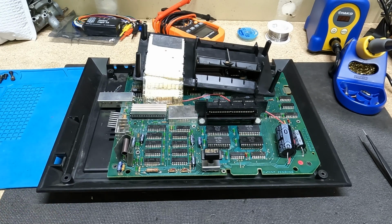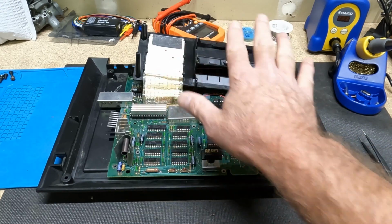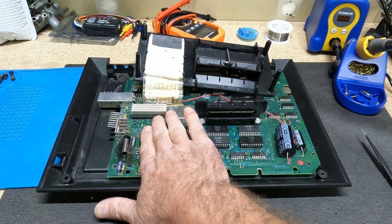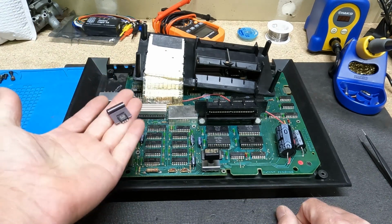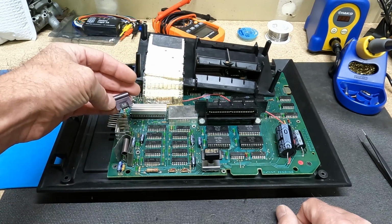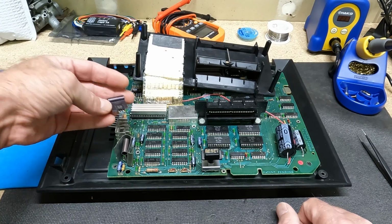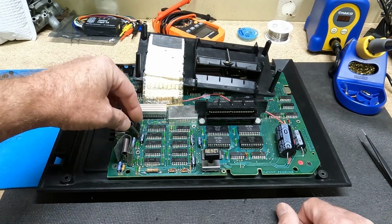when I was tapping around, I decided to see if there was any hot chips that were abnormally hot, so I took this all apart, I hooked it back up, started feeling all the chips, then I got over here, and there's supposed to be a voltage regulator right here, and I actually have it right here. This voltage regulator was broken off. It had one. Well, I don't even think any of them. They were just barely hanging on. I believe it goes that way.